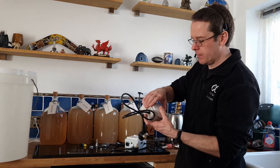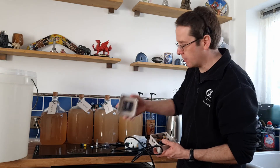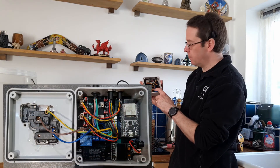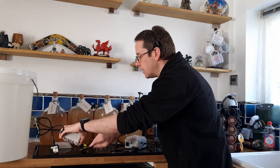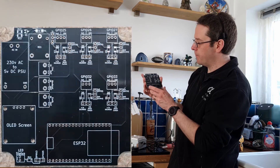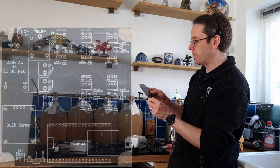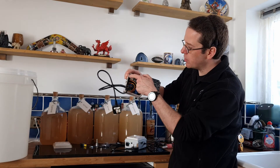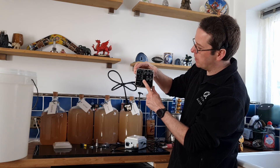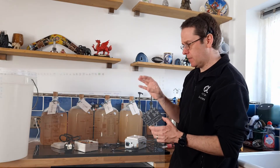Here's another one I made — I made three of them. If I take off the back, it's just an ordinary socket, the same as you have on your wall. On this side we've got a printed circuit board and some other components. This is the printed circuit board — designed by me, never made by anyone else before. I took the box, measured it, saw the corners and curves, then drew a PCB that would fit inside it perfectly. I worked out what components I need.